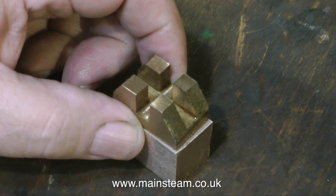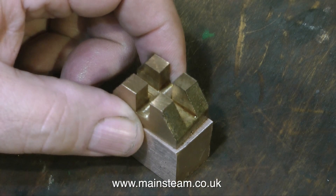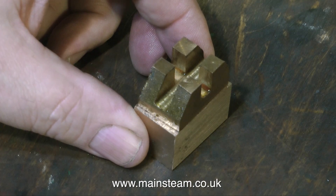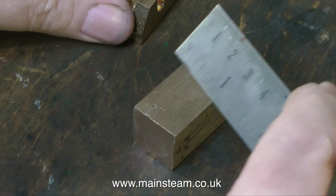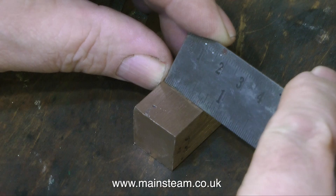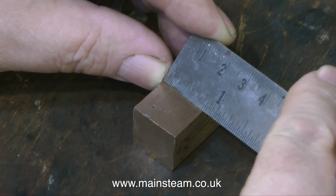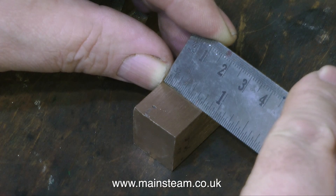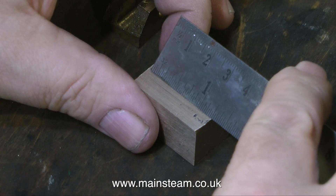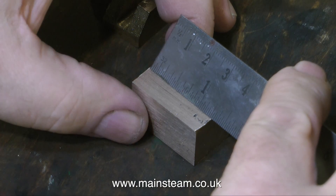In the clip currently running, I'm comparing the old valve with the piece of gunmetal I'm about to machine. I do notice that on the old valve — and when I check it with the ruler it confirms it — it is a little bit short. No surprises there then; the original valve is such a mess, none of the dimensions are correct. So after a quick look at the dimensions that I need, an inch and a quarter by three quarters of an inch, it's over now to the milling machine.